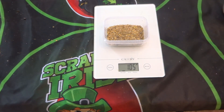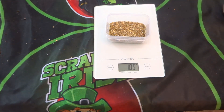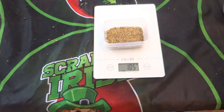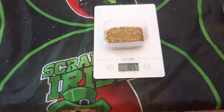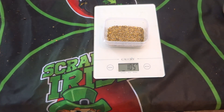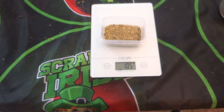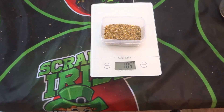That way the nitric won't be wasting its time on solder. Nitric is more expensive than HCL, so you won't be wasting your money using it up on tin solder. Some of it will be silver solder — on some CPUs they did use silver solder — so collect that up. All my waste stuff afterwards goes into a waste container and I'll process that further for silvers and platinum. For now, it's the gold I'm looking for.